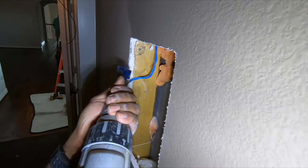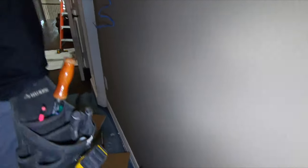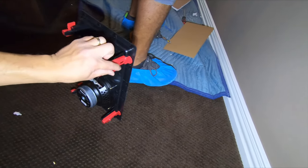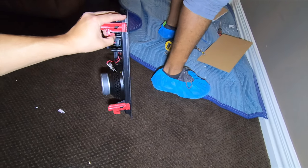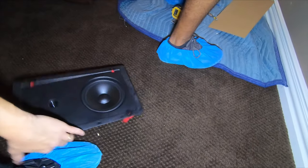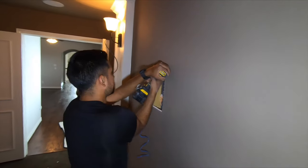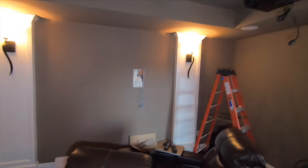Jerry's about to put some holes in the side of the stud. The reasoning is — see how these guys right here, they open to the side? Well, when you're right up against the stud, there's nothing for this to grab onto. So you're kind of forced to just put in a little groove in the stud, as well as down here, so that it has something to grab onto. That's what he's doing right now — putting a groove at the top and at the bottom. And then Sam's going to do the same thing over there on that one.